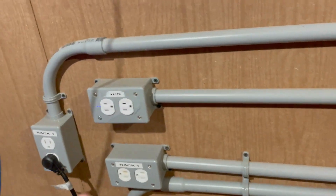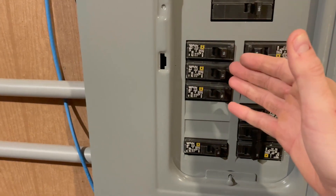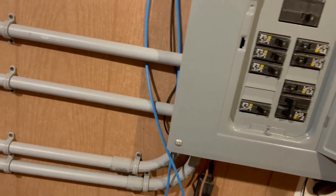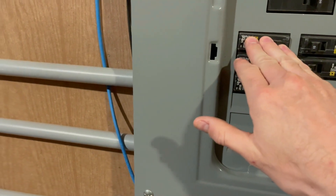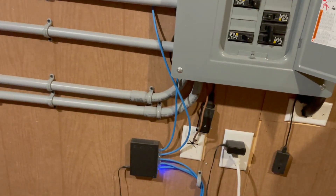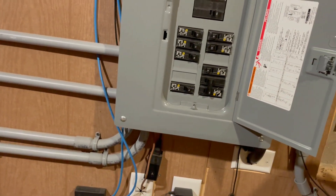As you can see, I have four 120 volt plug-ins. Each one of those leads to its own individual 15 amp circuit breaker - that's 120 volts because it's one single breaker. When you see two breakers like this together, that means it's 240 volts because it has two 120 volt wires going to that breaker. I gave each outlet its own individual circuit breaker because 120 volts at 15 amps can only handle 1800 watts, and you should run at 80 percent of that.